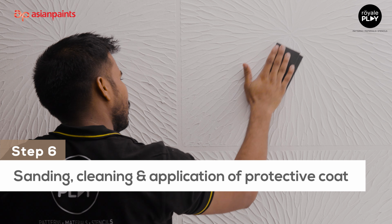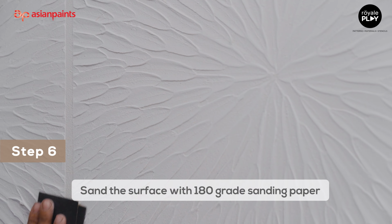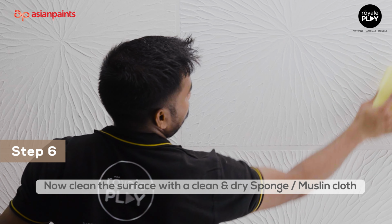Next step is sanding, cleaning and application of protective coat. Sand the surface with 180 grade sanding paper. Sanding is to be done in pattern direction only. Now, clean the surface with a clean and dry sponge or a muslin cloth.